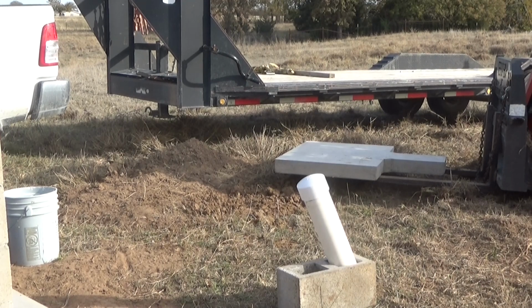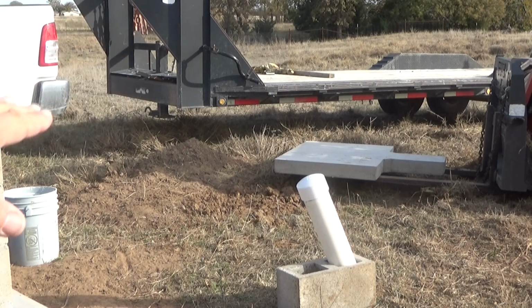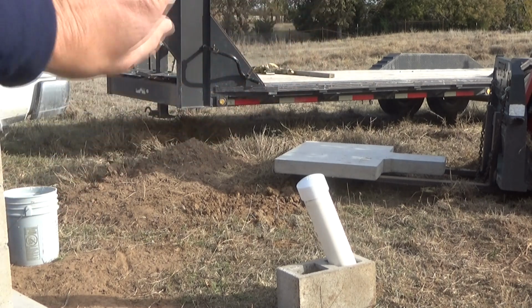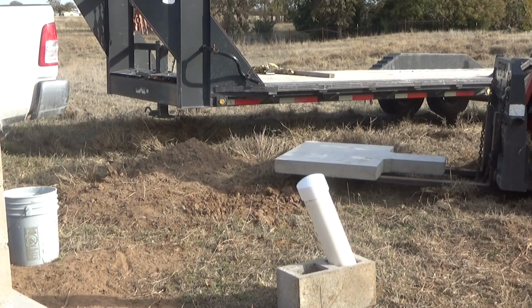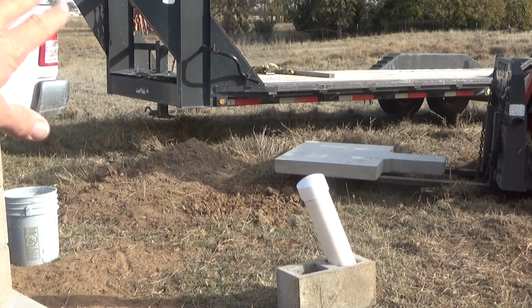I'm going to take that and set that down and work it over with the skid loader until it starts to come up. And then at some point, I'm going to have to grab it when most of its weight is down on the fulcrum point, so I'm not having to move so much weight. I'm going to flip it over there. There's a pile of loose dirt that I excavated when I leveled this pad site. And that loose dirt is going to be a soft cushion, so if I can't manage the weight as it comes over and it gets away from me, it's going to be hitting soft dirt, and it won't have to go as far because that dirt mound is about 12 to maybe 14 inches tall. So we'll see how this goes.